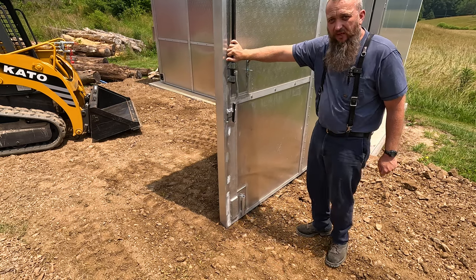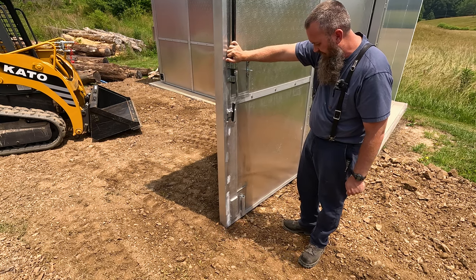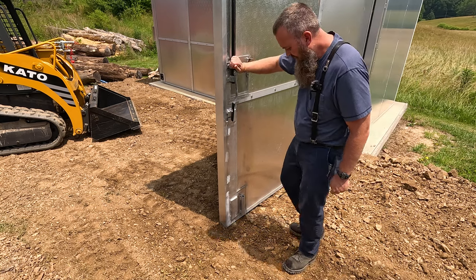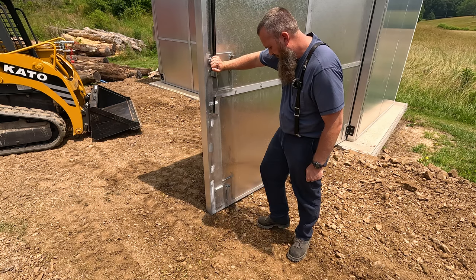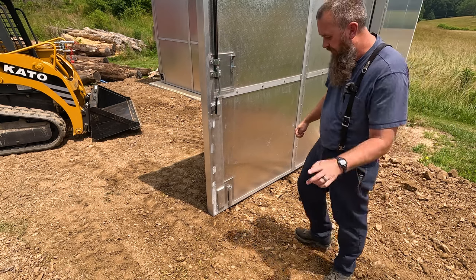And this door does have that high dollar rubber gasket on the bottom, so I don't want to make it tight where it's going to drag on the ground. That will damage it and I'd have to replace it. So I think I got it just about where I want it right here. If you guys help me remember this spot right there, I'll come in here and drag that or cut that down just a little bit. Now that should be enough. Keyword, it should be.